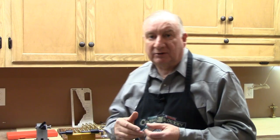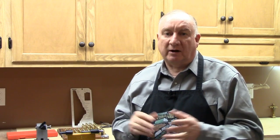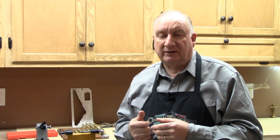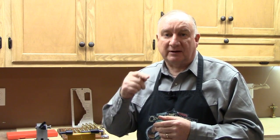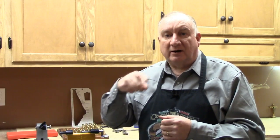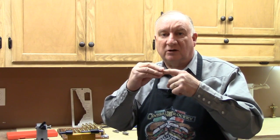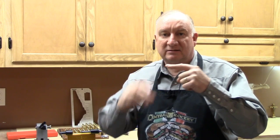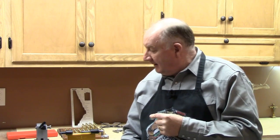It's typically something that you do when you first acquire brand new cases, and they're all fresh and clean, and there's no dirt on the inside of the case mouth that would cause problems with it turning on the pilot. The pilot is the centering device which controls the thickness of the brass at any given point around it as the cutter goes around it. So basically it maintains a standard.